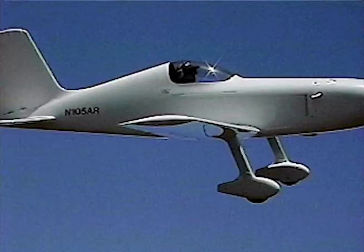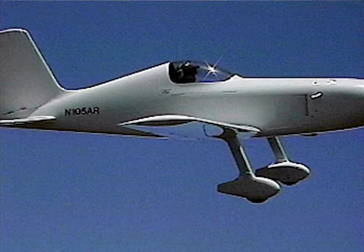The result of all of that is that the airplane will, in a stall, drop a wing. I get good aileron control right up to the stall, and so far as I know, a little bit into the stall I still have ailerons, but it appears to be breaking. The stall appears to be breaking all at once, which means that sometimes it drops a wing, sometimes it drops the nose. It's a tapered planform. Any other questions, sir?